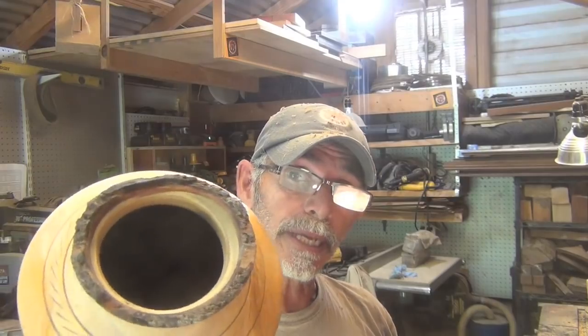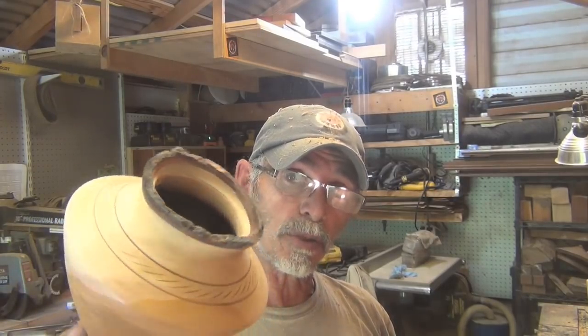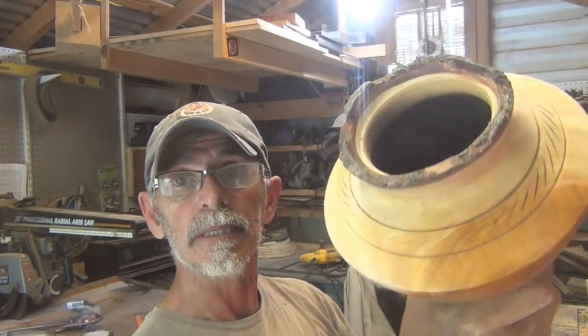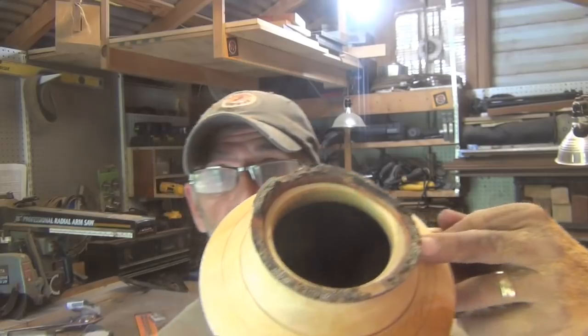Inside is not bad. The wood was rough cutting. A lot of raised grain with all the cuts on this. Reminds me of some of the woods that I've done that I really could not finish off. To get it somewhat smooth on the inside, I ended up torching it all inside to dry up those fibers completely and was able to scrape them off and sand them. That helped quite a bit, but still not a piece that I'm extremely proud of.